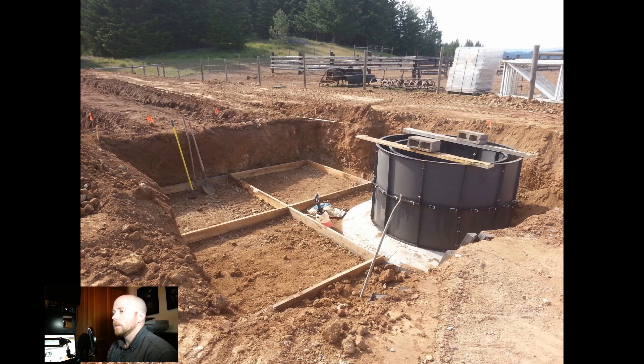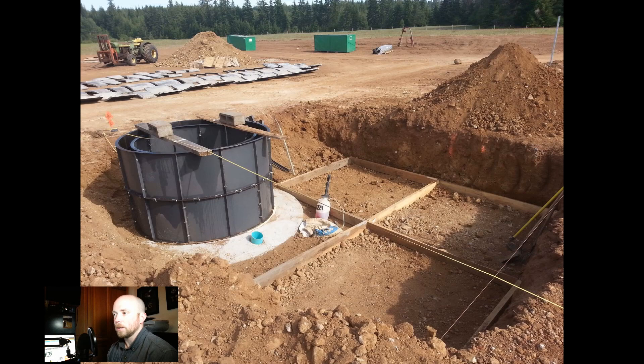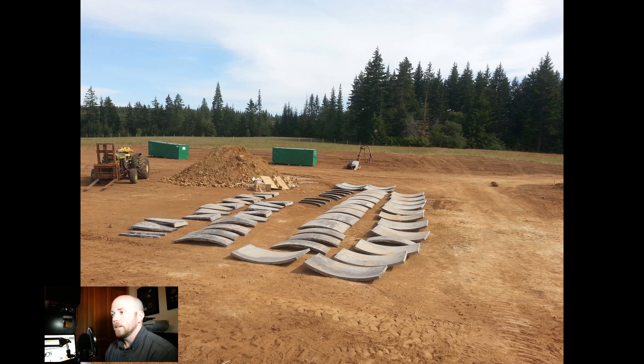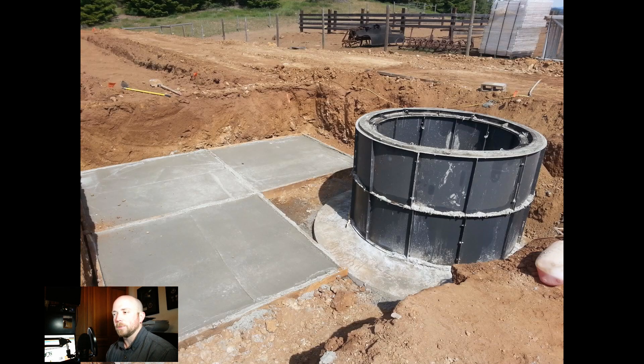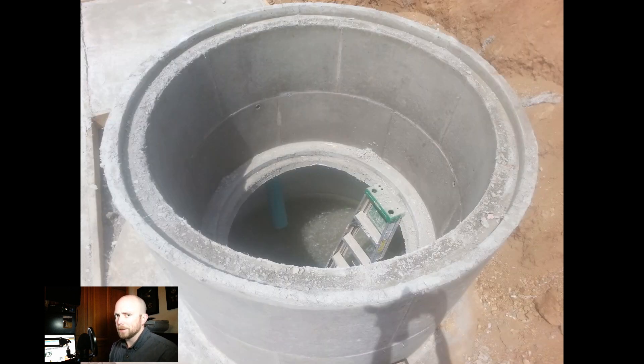Backfilling is always fun after digging a hole! We're backfilling to restore dirt integrity. The neck is ready to pour — bricks on top help with hydraulic lift and diesel was sprayed on the frames so cement doesn't stick. We poured the pads: the far back right pad is for liquid digestate storage, the left-side pads are for methane storage. Between the neck and two additional storage tanks, there's about 250 gallons of methane storage total.